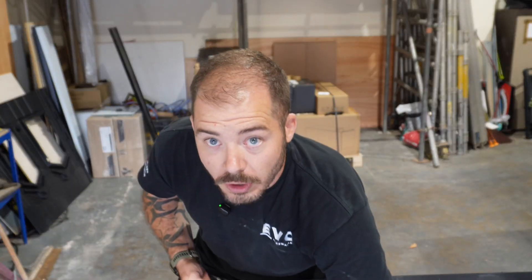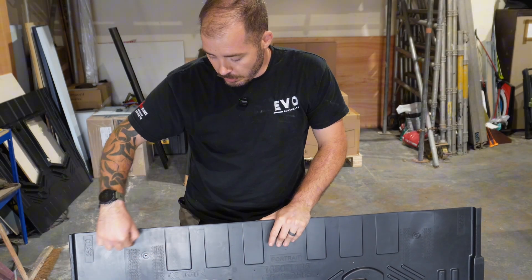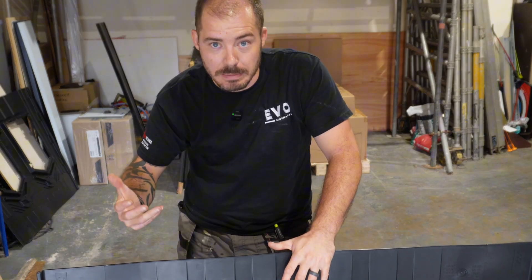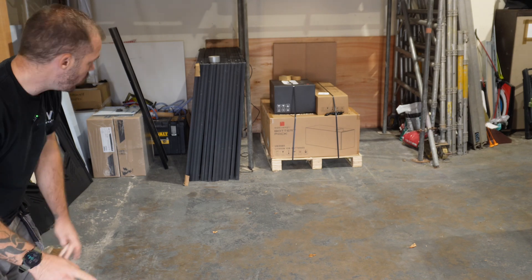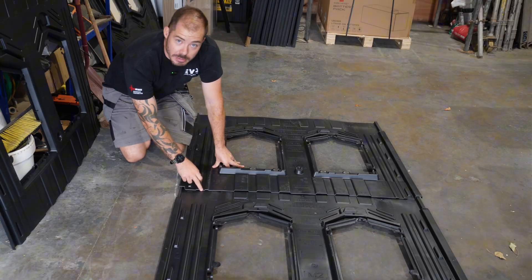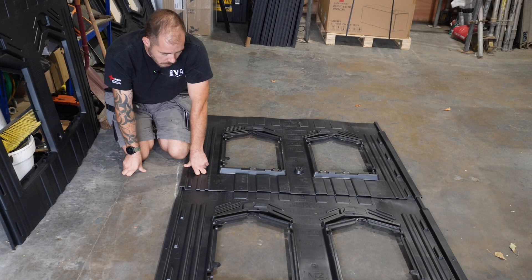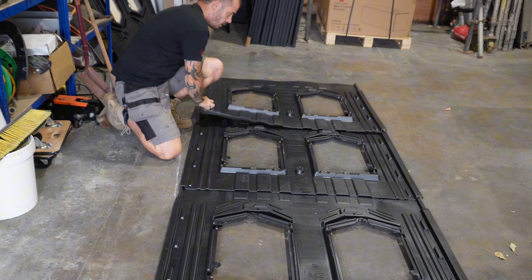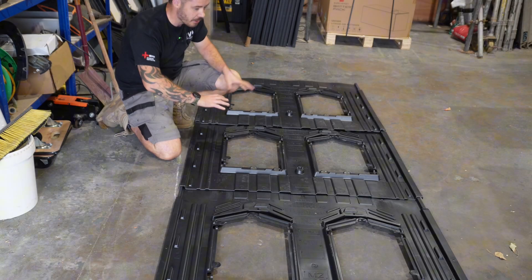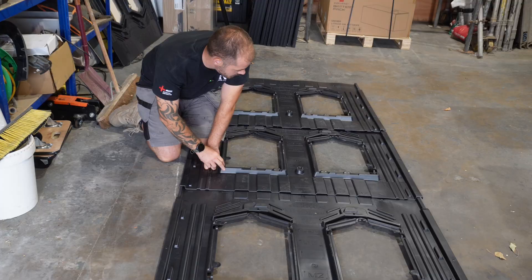Something that might be more useful for installers — but good to know for homeowners too. When looking at the GSE tray, it's got some numbers on it. A lot of installers seem to think these numbers represent the length of the panel — like 1740 — but they don't. These are used with a table in the GSE configurator, which tells you based on what size panels you're fitting which number to line the two cells up with. What we do — because measuring from the configurator is a lot of effort — is grab a panel, lay it out, and see where those numbers sit. The importance of that is we want the end of the panel to finish at the end of the tray. If you get these numbers right when double stacking, the next tray will fit flush to the top and there's no gap between the two — it all looks neat. So take time to measure your panels first; don't assume these numbers are your panel sizes, because they're not.